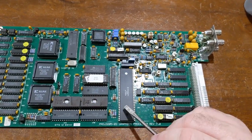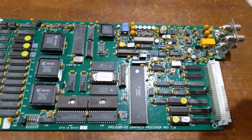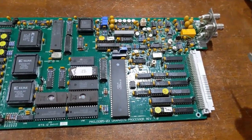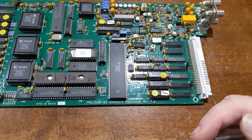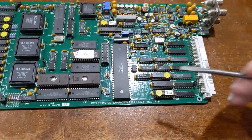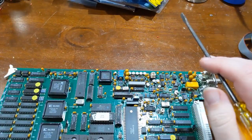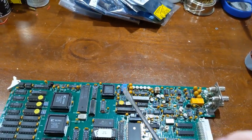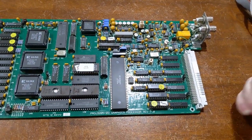So you can have this processor go off and say, I need to retrieve this information, or I need you to set this information, or I need you to do this or that. You can vector all of that out without needing a large if-else block, because there's nothing worse than having if command equals this, else if, else if, else if. You can do away with all of that by using the IRQ vectoring.